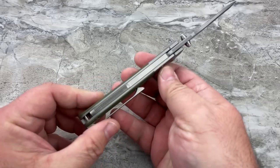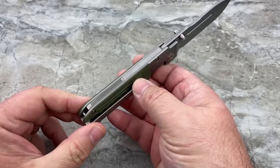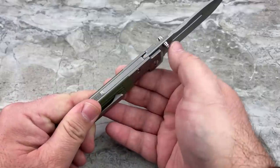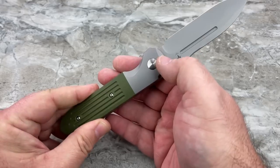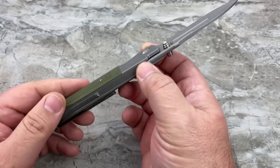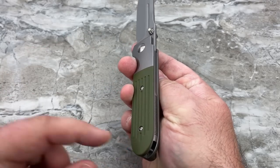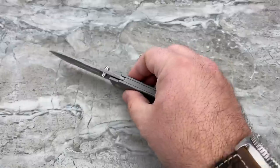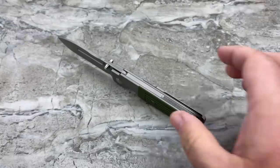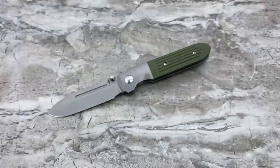A couple of features I find very interesting about this. Number one is this backspacer — it's not just a backspacer. The backspacer actually doubles as an inline blade stop. So when the blade is open, it doesn't engage an internal stop and there's no external stop at the bolster. It's actually engaging right here into the backspacer, running from here all the way around. I think this is part of the genius of Patrick coupling his business with Michael Veneno — you're going to get some more creative, out-of-the-box ways of making a knife. Inside, you've got ceramic bearings, so you're going to get a very, very smooth action.